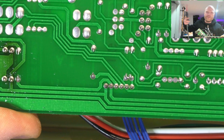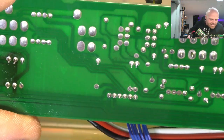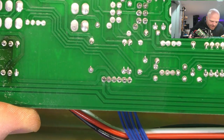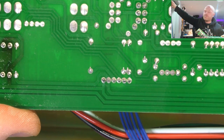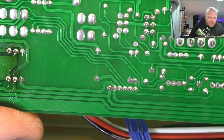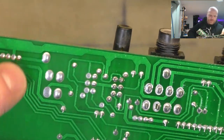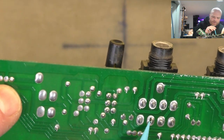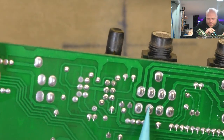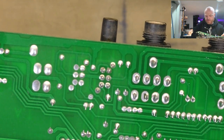Oh, I'm blowing it. I've got a compressor right here. Yeah, I think that'll be good. I'll clean those solder joints off and reflow them though, because they look pretty corroded. Here's that solder joint where you can pass your probe through to the other side of the board. So yeah, we'll clean this one up, stick it back in, then we'll have another close look at the preamp